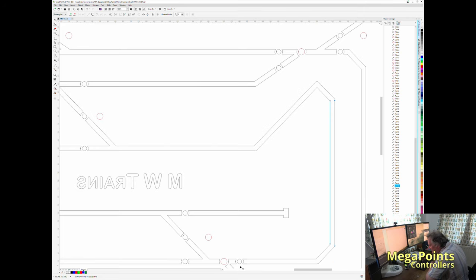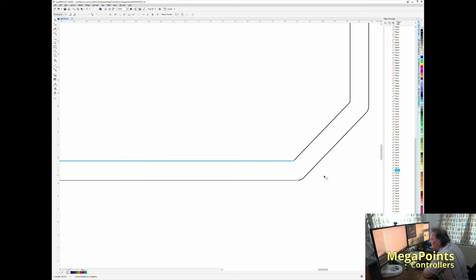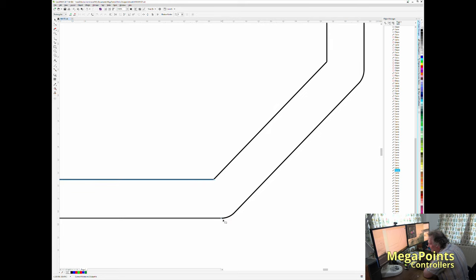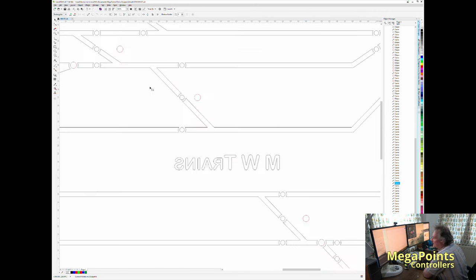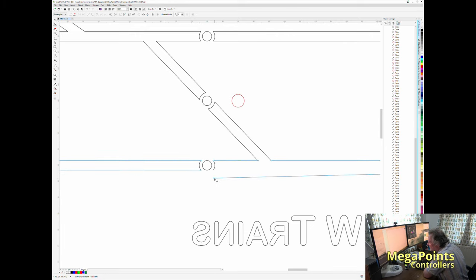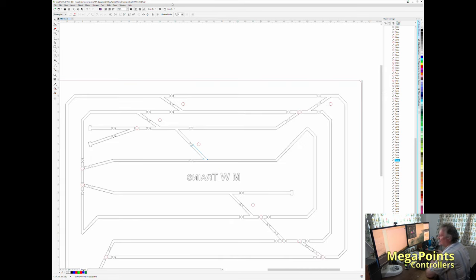Okay, let's take it down to here. I'm seeing a bit of a line there. Ooh, I wonder if that's it. Oh, look at that. There's a line there. That's the only error. Great. Let's just check these corners while I'm here. They were clean though on the last one, so... Happy with that. Just while I'm here, may as well check it out. And we got something happening there. Nope, nothing underneath. Nothing underneath. It was just that one line that was under another line. That's enough to confuse the laser cutter. So to be a true vector, it has to be cleaned up.